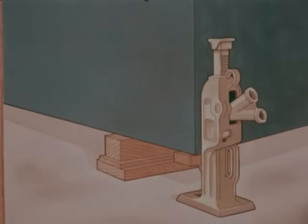In jacking heavy equipment, it is a good practice to follow up each lift with temporary blocking. Scraps of 4x4, 2x10, and 1x6 blocks of wood can be used in various combinations to follow the load as it goes up. The blocking should be uniform on each side and each end. Should anything fail, the load would be limited in the amount it can drop down.